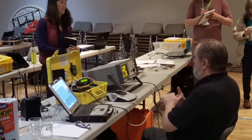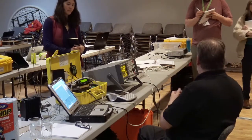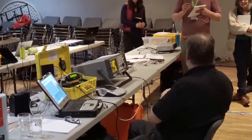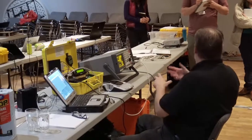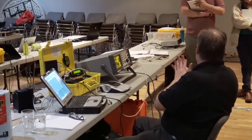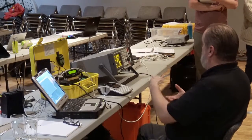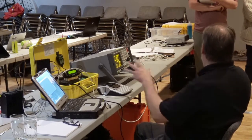Yeah. So they're pretty efficient devices. They're pretty bulletproof. They've gone through a whole pile of changes. If I had my way, they would have never gone to USB. USB is not quite as forgiving as the RS-232 version. And if you wanted to do a node stack where you have to cross from one TNC to the other, you do it on the DB25. So it's a little hard to do that when you've got a USB port. But with the USB port, where are you going to find a computer today that's still got a DB9 connector for a serial port? So that's where we are as far as tuning them up. That's why we chose it as a standard down in my area, the Capital Regional District, and every EOC basically has that model.